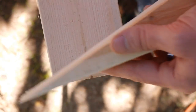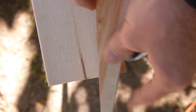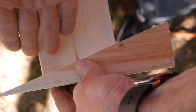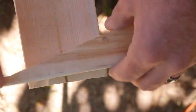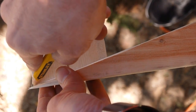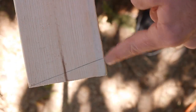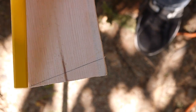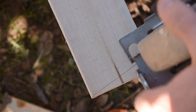Now this is one of the pieces I cut off the top. I want the same angle but it needs to make the other angle 90 degrees. Instead of cutting it at a crazy angle, I'm gonna set this cut piece flat against the side as a pattern to mark the angle. That way when I cut it, this 2x4 will sit flat on the ground while the angle up top goes straight up and down, perpendicular to the ground. I'll mark those off on all the feet, make sure I put it in the right direction.